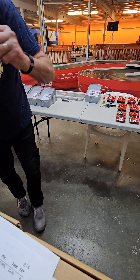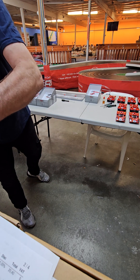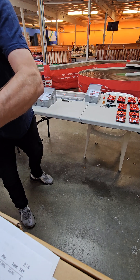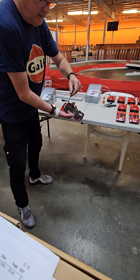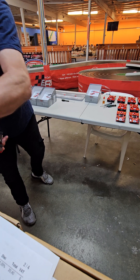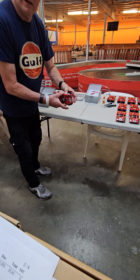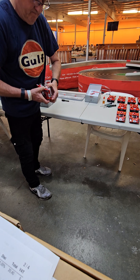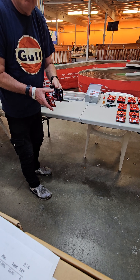I've got a little pool of WD-40 sprayed onto a piece of card so I'm able to pick it up on the end of this allen key — just wick it down around the head of the allen key. I'm not trying to lubricate the allen screw; I'm trying to lubricate the o-ring. Get it all the way down in there, wiggle it around, and that movement is important because it's going to distribute the WD-40 onto the o-ring, then pop it off.